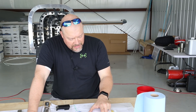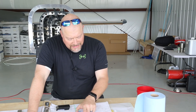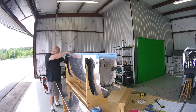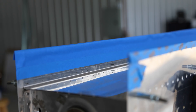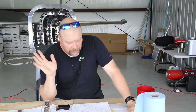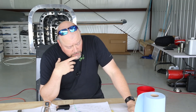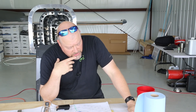It says use a maximum of three-sixteenths inch bead of sealant — too much and the thickness can start to build up, making the tank difficult to install on the wing. I've put blue painter's tape across there to prevent that, per the suggestion of one of my viewers. Then it says put a bead of sealant along the inside edge of the flange on each rib, and put a heavy gob of sealant where each corner of the baffle will meet the end ribs, as this is one of the most common locations for leaks.